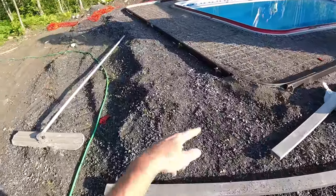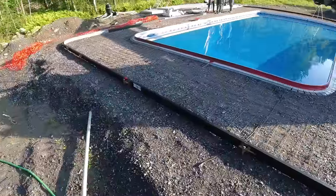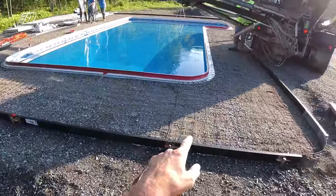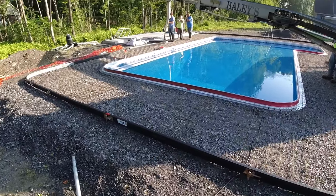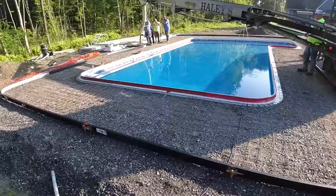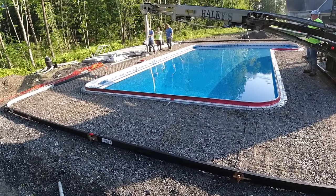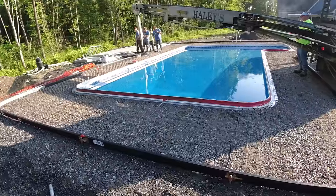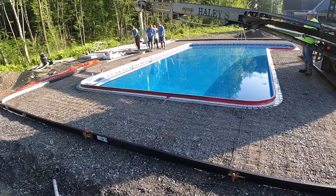We're using polymetaforms, the rigid forms here for the exterior forming system. And we're using Z pool forms for the concrete coping, which we love, with a slate liner. So we're just getting going. We're using 4,000 PSI 3/8 concrete with fiber mesh. We got some gray integral color in it. And we're gonna use a clear liquid release today for the stamp.